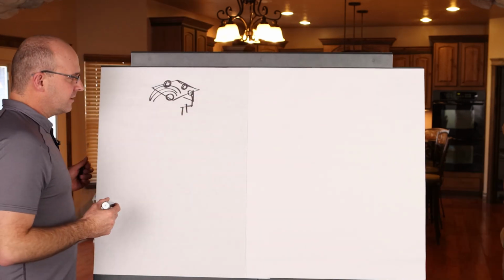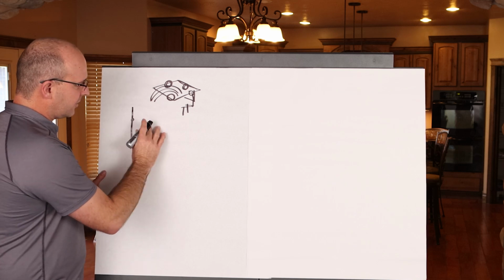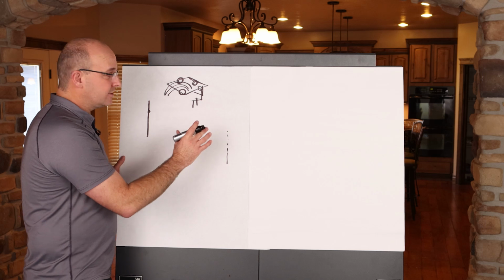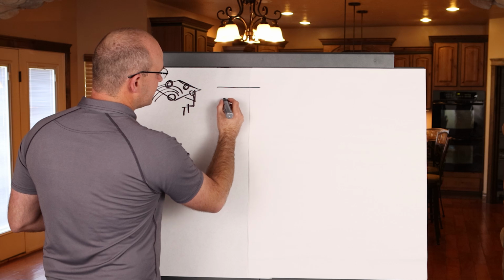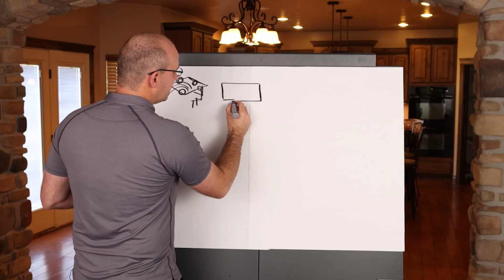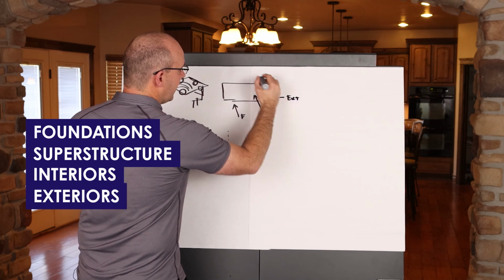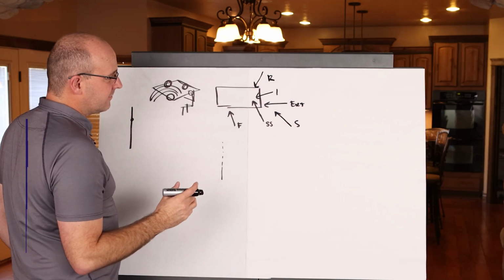The review of the drawings is done and I'm going into sketching mode. Typically what I'll do is I'll obviously identify a start date. If you have an end date or a stipulated deadline or substantial completion deadline, you'll write that here as well. But what I like to do is break up my building by phase. So let me just give you an example here. Let's say that I have a building here, and I'm just going to draw the elevation of it. I'm going to have my foundations, my superstructure, my interiors, my exterior, my roof, and I'm obviously going to have my site. These are the different phases that I'll have for this building.